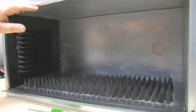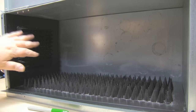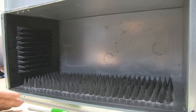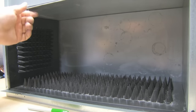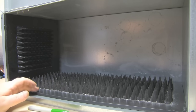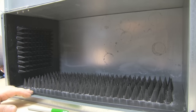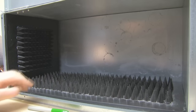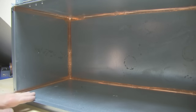When it comes to attaching these, I've decided to use epoxy and also cut the tiles so they all interconnect with each other. I'm going to cut the side tile down a little and the one on the opposite side as well, so they'll help support the top tile — the ceiling of the enclosure. The back will be cut so it's held in place by the sides, the bottom and the top, giving strength from each tile holding the others, plus the epoxy. The epoxy doesn't stick well on smooth metal so interconnecting them adds strength. I really wish I'd cut the tiles down to size before sticking the cones on, because the dust gets everywhere.